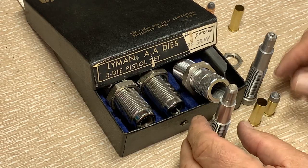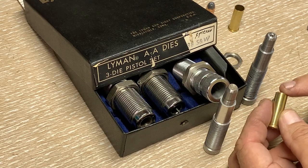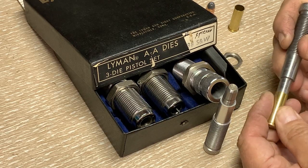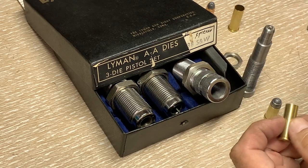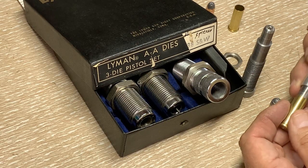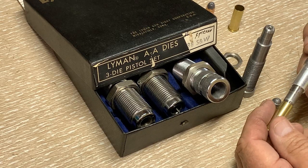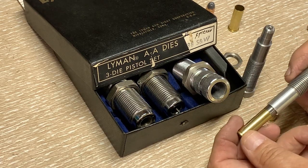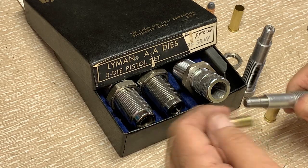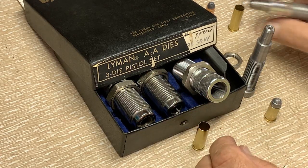Let's talk about what we're really looking at here. This is a 38 Special case — I did not yet cut it down — and I used the new expander to get the .362 dimension in there that I need. By difference, the original is about .351 or .352, so it's really not made to do the job. There's a little step on it that's exactly .362, and this prepared round will actually go up on that step now. It's a little hard to see, but there's a step and then a fence, you might call it, so that the case will not go beyond there — and if it did, it would be damaged.